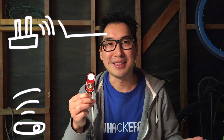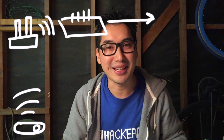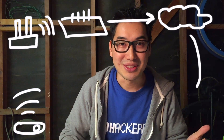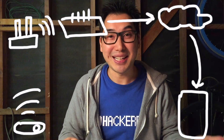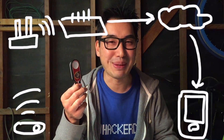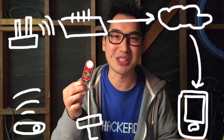What's actually happening is this is connecting to your Wi-Fi router, it's sending a request, and this thing tries to intercept the request and converts that into something it sends to Google to send the text message. So it takes a little bit of time — maybe about 20 seconds — but it's 20 seconds I can live with because this thing is so cheap, runs off a AAA battery, barely uses any power at all, and you just don't have to worry about charging it.